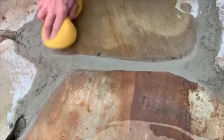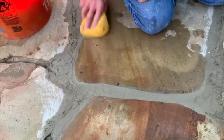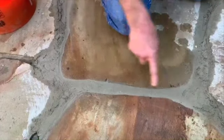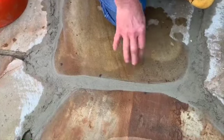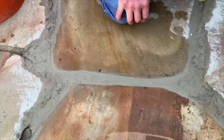The bucket is already filling up with debris pulled off the stones - it'll get saturated so I'll just keep filling up with clean buckets. It's important not to wait too long, but the longer you wait the drier the mix is and the easier it cleans up - that's the beauty of a dry mix to begin with, it's not sloppy when applying. I hesitate to work it too much because then I start drawing mortar out of the joint. I'll come back later tonight or tomorrow morning to scrub it again.